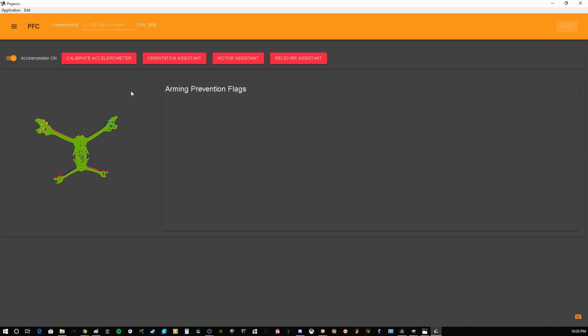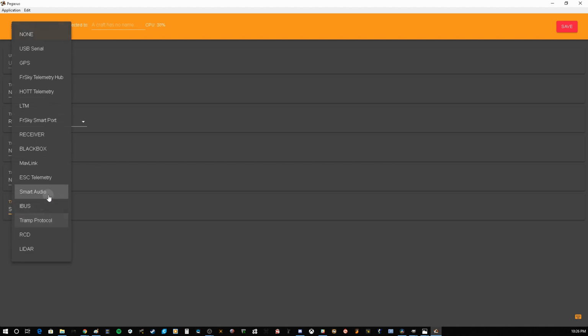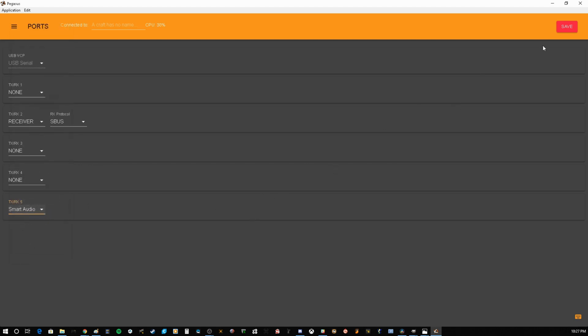All right, so pre-flight check. Right now I have no RX. Well, I haven't connected one yet, which I'll be doing in the next video as I build the quad. I do like to just set up some basics as I know what I'm planning to do. So I'm going to go ahead and go to ports, make sure that my receiver is on UART2. It's currently set to S-Bus. I'm going to set my smart audio up on UART5. Go ahead and hit save there.